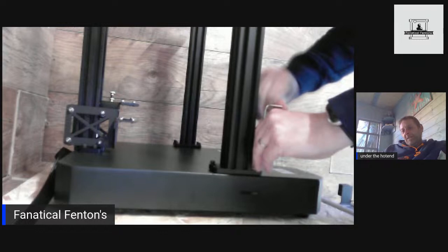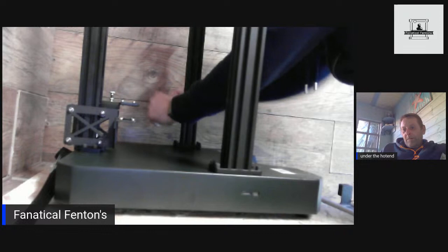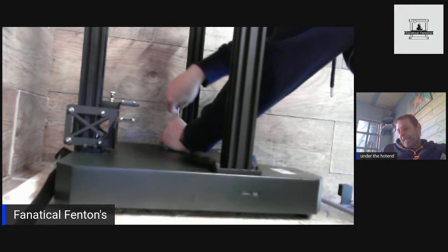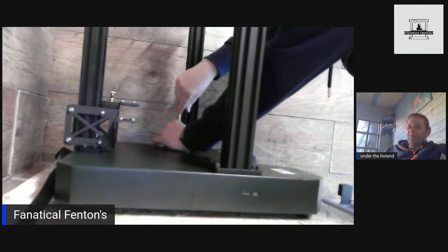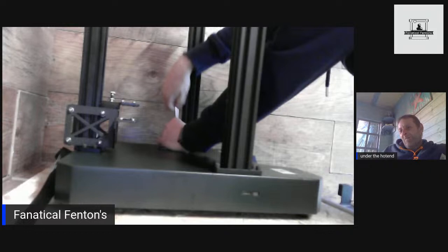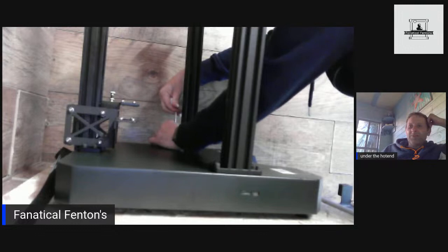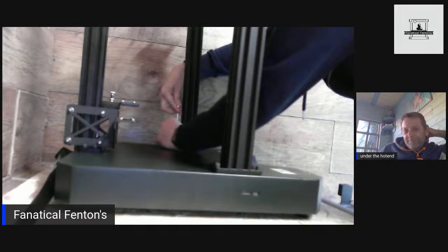The thing is, if you've got 10 printers sent to 10 people, every single one will be slightly different — there's no consistent outcome. On one of the forums the CR10 Smart, the amount of people having issues with the bed leveling and the build plate not being level is crazy. My Frankenstein build started out with a Volcano, replacing tubes going direct drive, then all-metal hot ends, rods, diagonals, and then I changed boards and steppers — pretty much everything got swapped out.